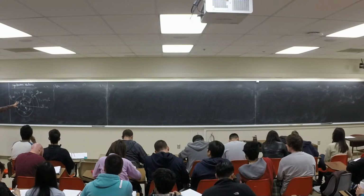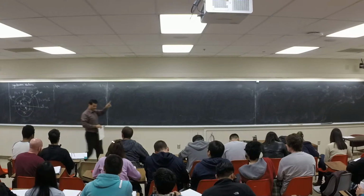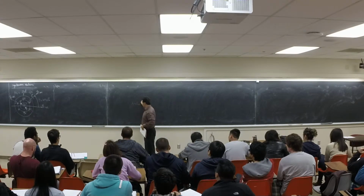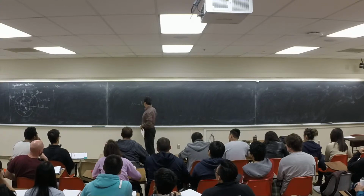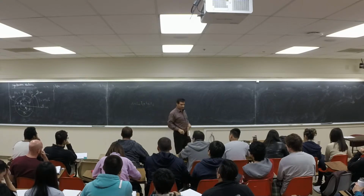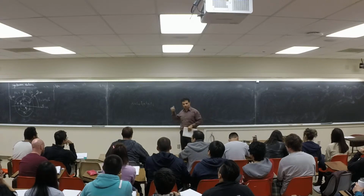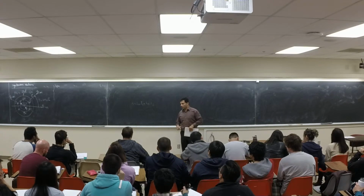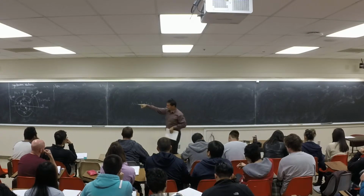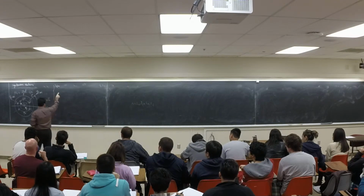I have a 4 winding system here. Let's go back to the exam you had. You had a 2 winding system, right? Then we said lambda 1 is L11 I1 plus L12 I2, right? If I have 4 windings, L11 I1 plus L12 I2 plus L13 I3 plus L14 I4, all of them, times the current. How many windings do I have here? 4. So basically I should put 4 terms here.